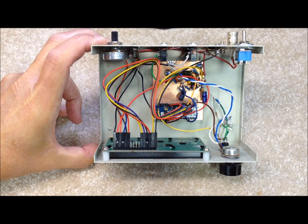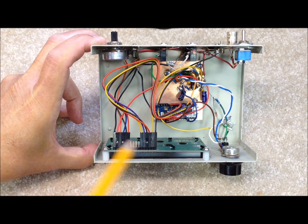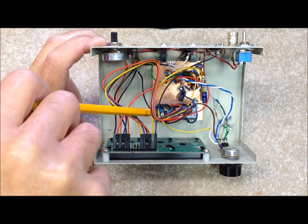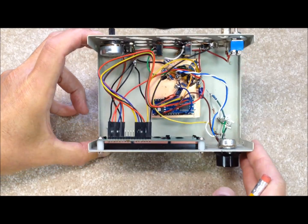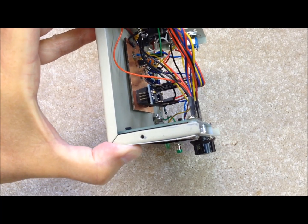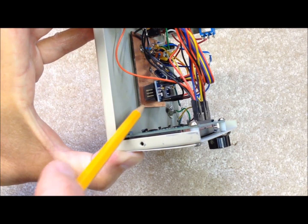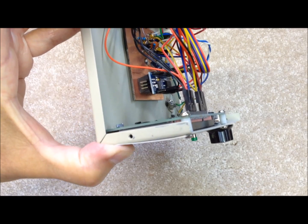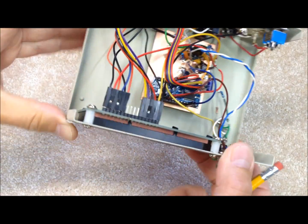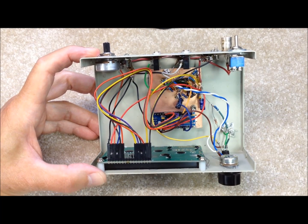There are only really a few components involved to use that decoder chip, and the output of that chip is fed into our Arduino. We ended up using the Arduino Nano — this little guy right here — it's physically small. We got the last batch delivered to the door for about $4.25 each, which is pretty hard to believe. The Nano itself is mounted on a little rubber standoff to get it up off the metal copper foil board. That little rubber standoff is just glued to the board.